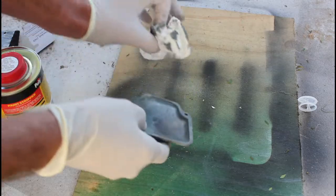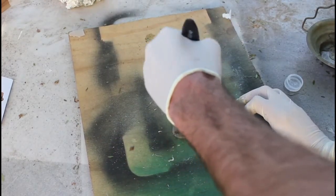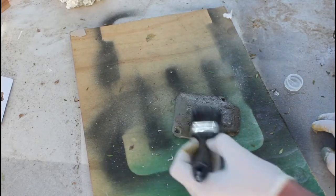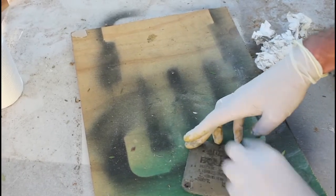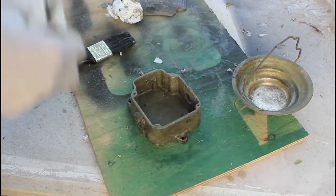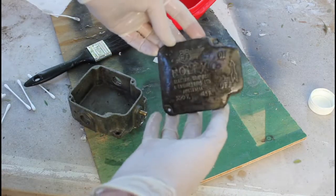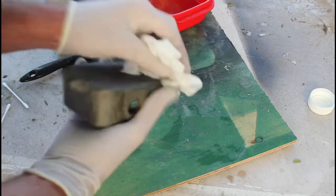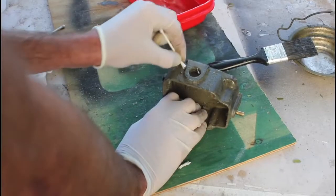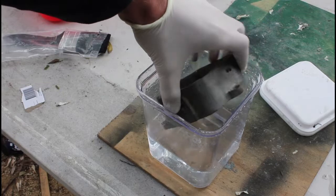I'm using the paintbrush to dapple the paint stripper right into the lettering so I can get all the paint out of all the little nooks and crannies — this side took several treatments as well. Stripping the paint off this side of the faceplate was actually the hardest part of this entire process; all the little tiny details need to be cleaned individually. I ended up using Q-tips just to make sure I got everything out from in the letters. The mounting block side, while not as difficult as the faceplate, was also very tricky because of its dish shape. Once everything was stripped, I gave it a quick rinse in a fresh vinegar solution and let it sit for another 24 hours to make sure all of the paint stripper, rust, and oxidization was off the bare cast iron.